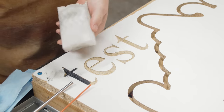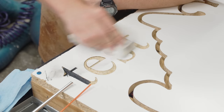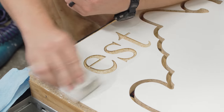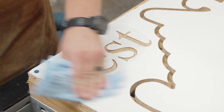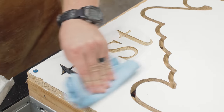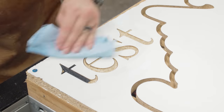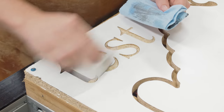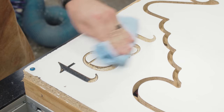Melamine is a little bit porous, so anything that gets out on top of the surface just stains no matter how you wipe it up. Water, isopropyl alcohol — it just did not clean up well at all. So ink is out of the question. We're just going to go ahead and cut it as a normal V-carve.